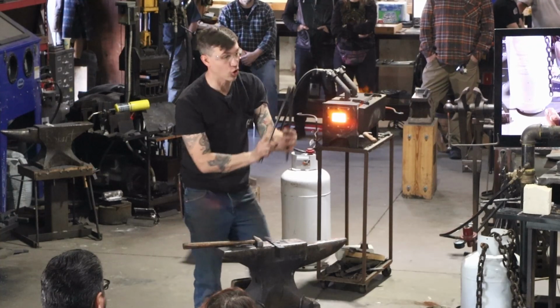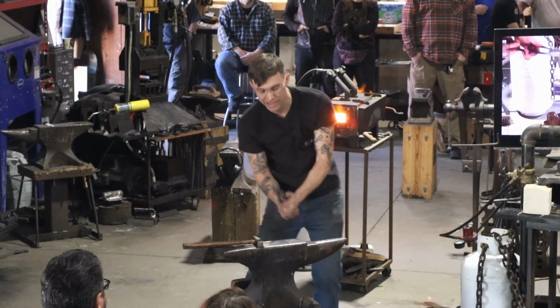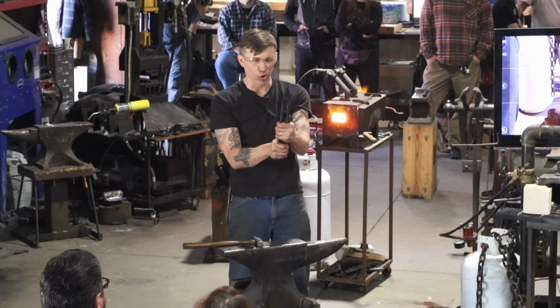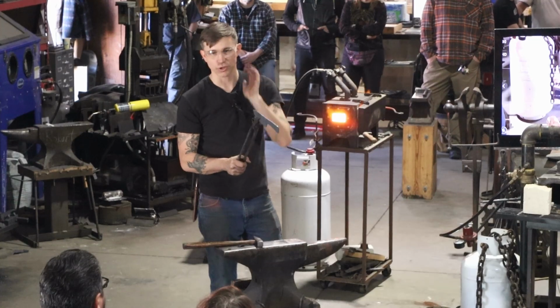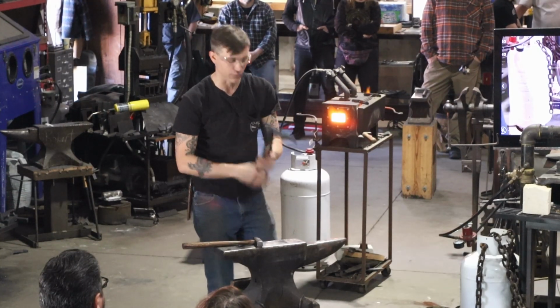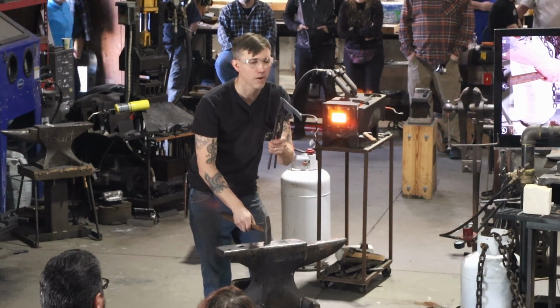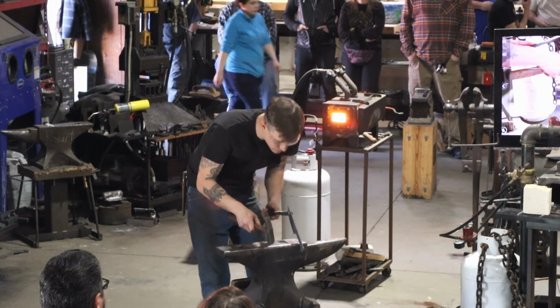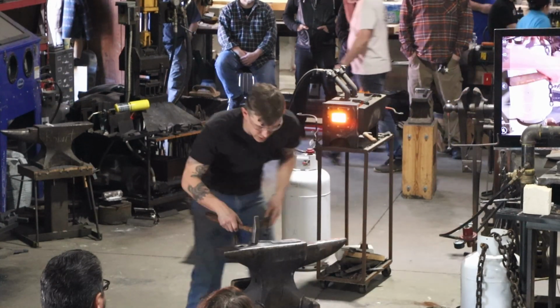When straightening, I always switch to regular tongs that can pick it up from either side, because I gotta be able to sight the whole thing, and any kind of tongs that wrap your project are gonna really obscure that vision. It makes a huge difference. Probably not gonna go crazy.